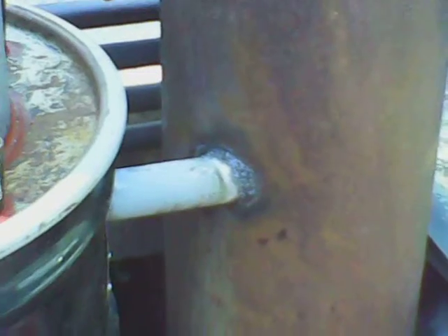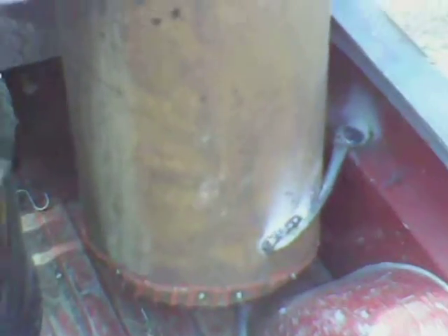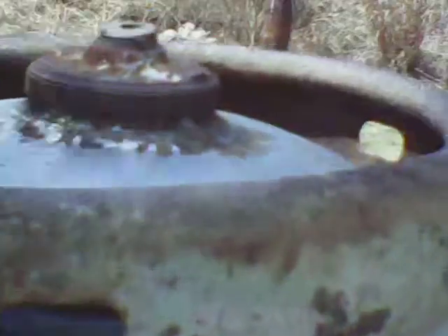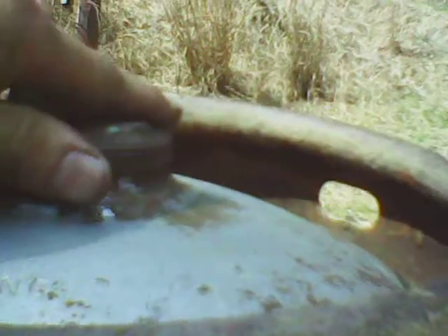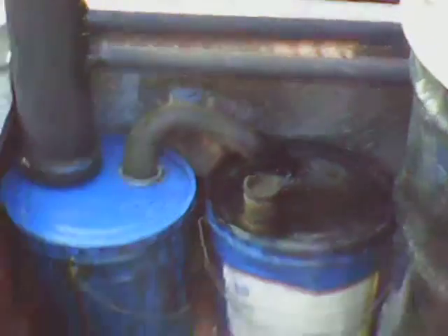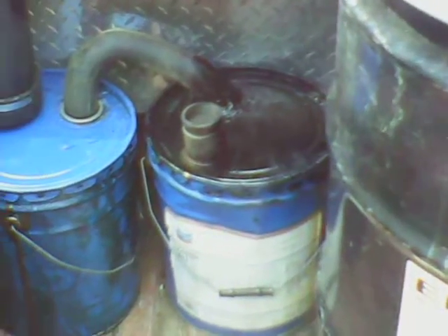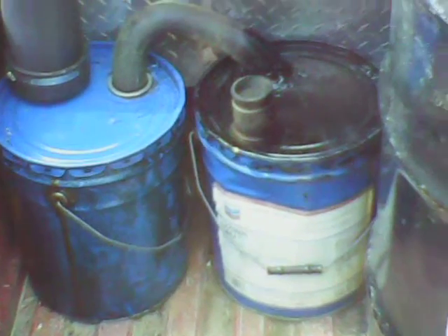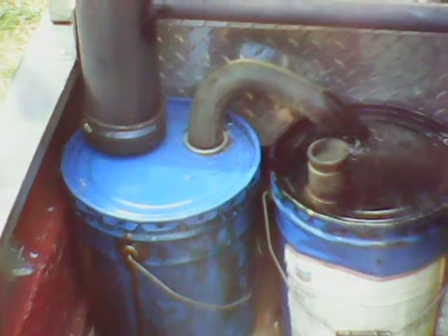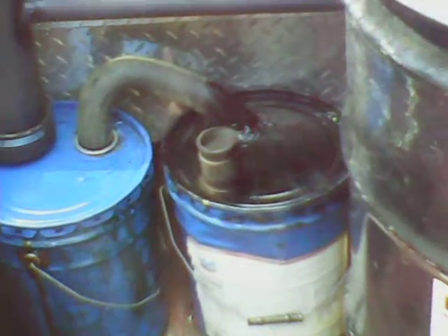It was not blowing out of any of those connections. It was blowing out of my small cyclone filter — out of the top of it — there was no way I could get it to seal. This system so far doesn't have any leaks that I can see. The only place smoke came out was the air inlets, and a little bit from the top, which I haven't finished yet. That's the one thing that really needs done to have everything in the bed finished. I need to do a test and see how clean it burns — I'll take a white cloth over the end of the vacuum cleaner to check for any tar coming out.